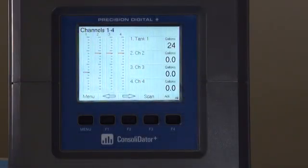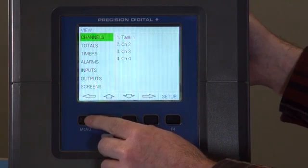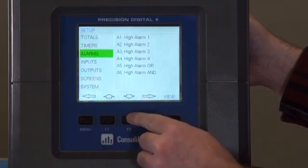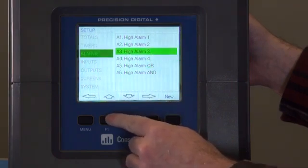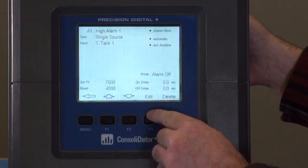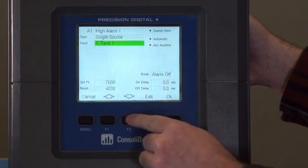Now that we've got our channel set up for our application, now we can go in and change our alarm set points. To do that, you go to the menu button, hit setup, and go down to alarms. We're going to change high alarm 1 for this demonstration. Here we have the high alarm 1 set for a single source, and the input is the tank 1 channel that we just edited.